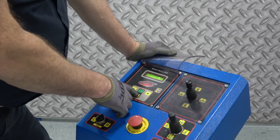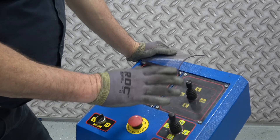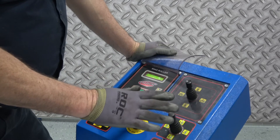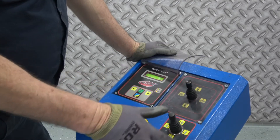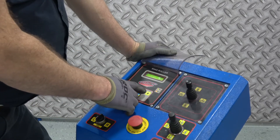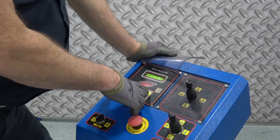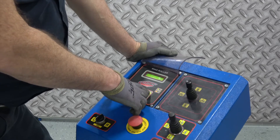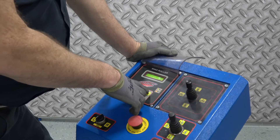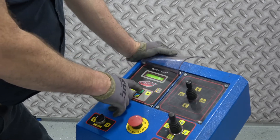Now I'm going to go back: cursor once, twice, three times. This right-hand column is the descent value — each time you come in, this is the amount it drops. So for this angle — two and a half, quarter leg out — I'm going to roll about seven. It should be a pretty good hit on this angle. To confirm and put it in the controller, I hit enter.